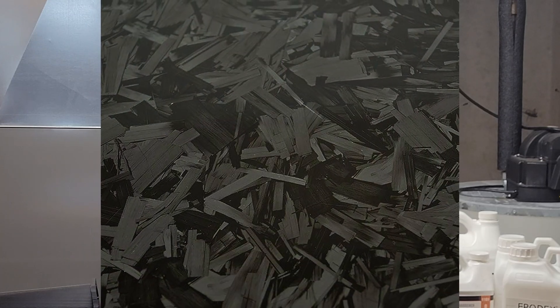What is coming in the future of carbon fiber? The biggest development right now is people actively trying to figure out how to recycle carbon fiber — it's typically been a one-use material, so once your part breaks there's not a great way to reuse it. Many companies are now taking cured parts, chopping them into tiny pieces, and using that as either a chopped-strand application or even making it small enough for 3D printing. A lot of filaments are coming out that are glass-filled or carbon-fiber-filled, which increase stiffness by incorporating microscopic amounts of carbon. Whatever comes next in this space is really up to you — there is no limit to how this material can be used.